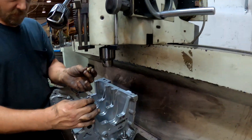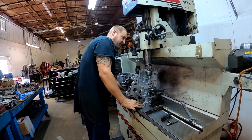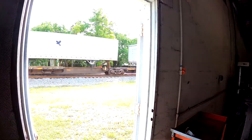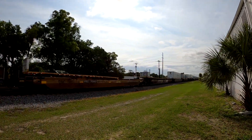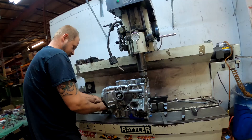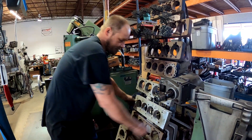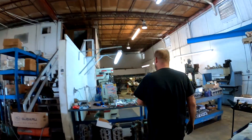This is an air float so I'm basically putting a centering pin in it. These plates here are the best — you torque these to the top of the block to simulate the head being torqued on. On extreme high-performance race engines it helps keep the bore more round for when everything's working together.